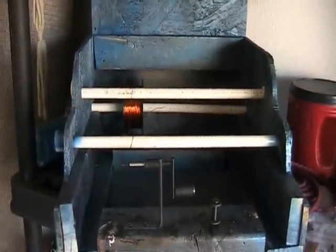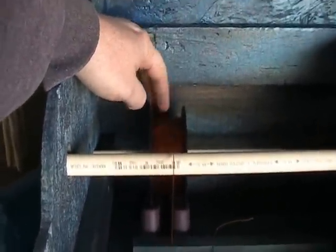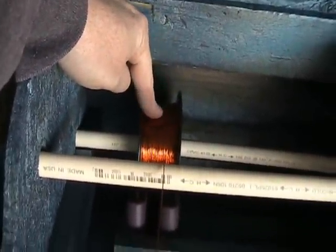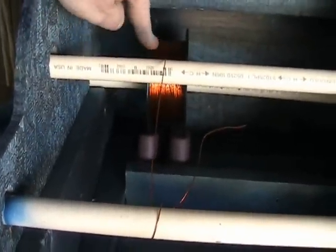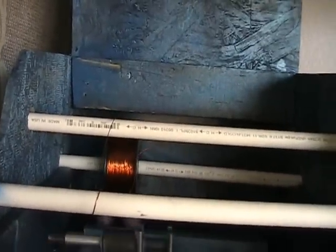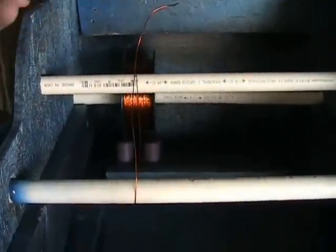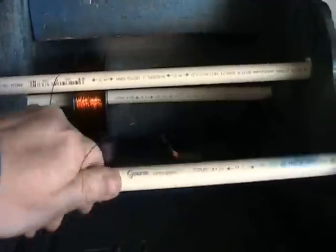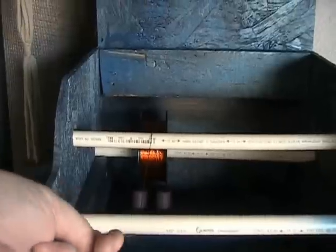For hand winding coils, I built a jig. Basically it holds my spool of wire — I just buy a thousand foot spool, about a hundred bucks. I mounted that up and took a couple of rubber door stops which wedge against the wheel and keep constant tension on it. You can see the little slight bow. Basically this takes about a pound of pressure to pull through, so I put it over and under and have constant drag to keep everything tight.